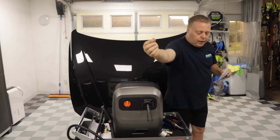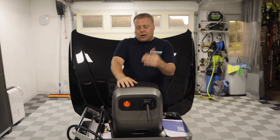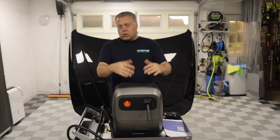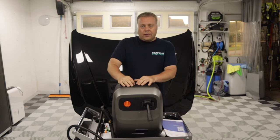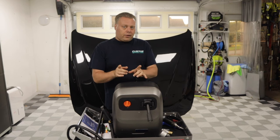With the instruction booklet, there's always a little pin clipped to it — this allows you to clean out your nozzles. A few people who commented on my videos thought their pressure washer was broken and not working right; no, it was just a little bit of debris caught in the nozzle.